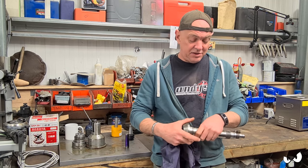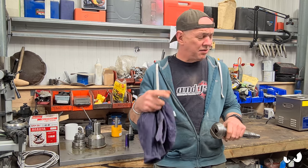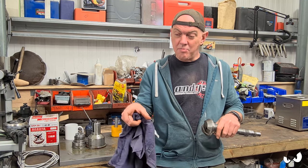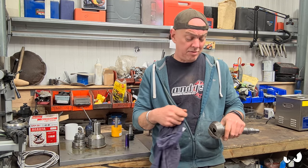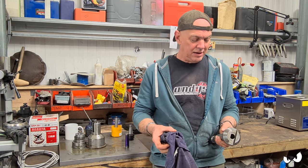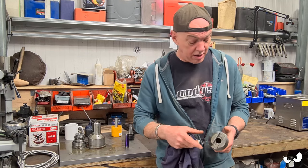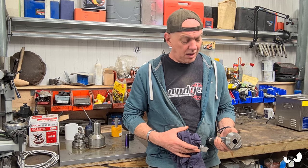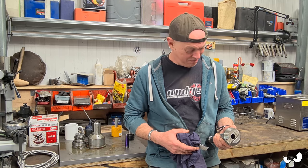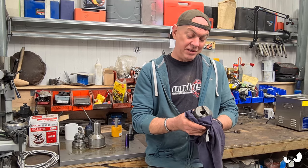So they made the suggestion of sticking it in the lathe, in a chuck, and then sticking a dial test indicator on the tool post and shoving the probe in and out of that and just changing the compound angle until it reads the same as you go left and right, and that way you can read whatever the angle is off the compound. And from that, hopefully figure out, with the height and so on, what taper it is. Their lathe is having issues at the minute and maintenance are fixing it, so that ain't going to be happening for a little while. However, I'm not really sure it's going to help either.